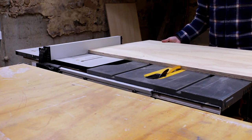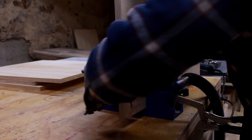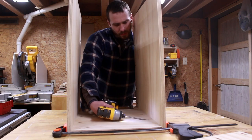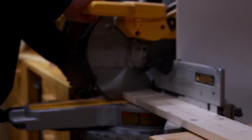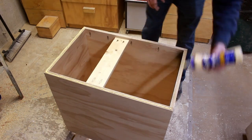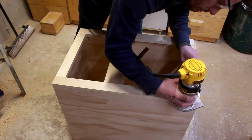I switched my focus to the cabinet portion of this desk. I cut out four sides using the table saw and made a square, keeping things simple with pocket holes because they are quick, easy, strong, and nobody will ever see them. I made a cutout for the top of the cabinet to allow me to extend the depth of the power strip compartment further. I then made an end frame for the back of the cabinet to support the pallet wood paneling, using pine since it will be painted. I assembled the frame using pocket screws and then glued and screwed the frame to the back of the cabinet. The sides were a little warped so I attached a temporary brace to straighten everything out before attaching the frame.